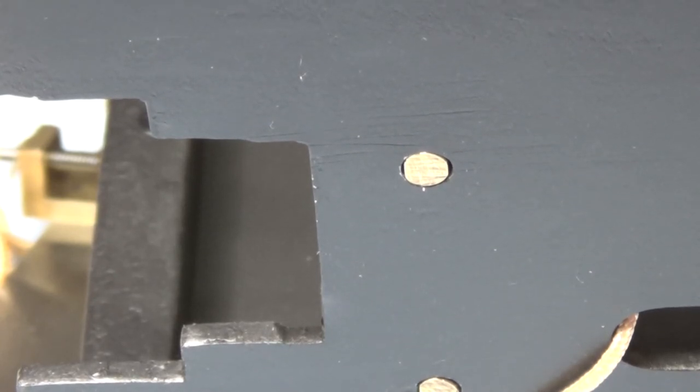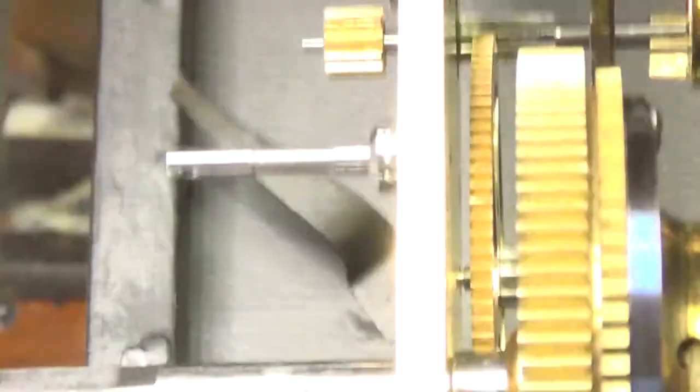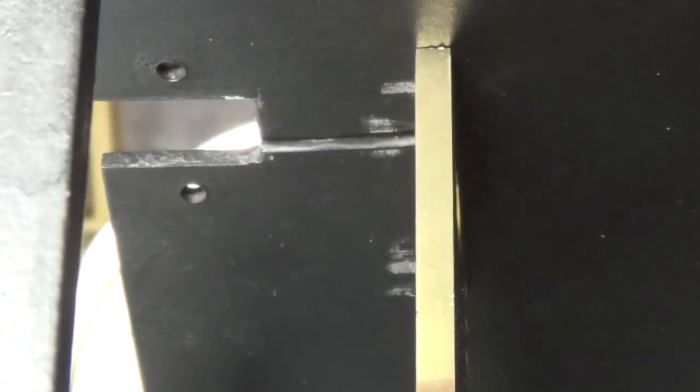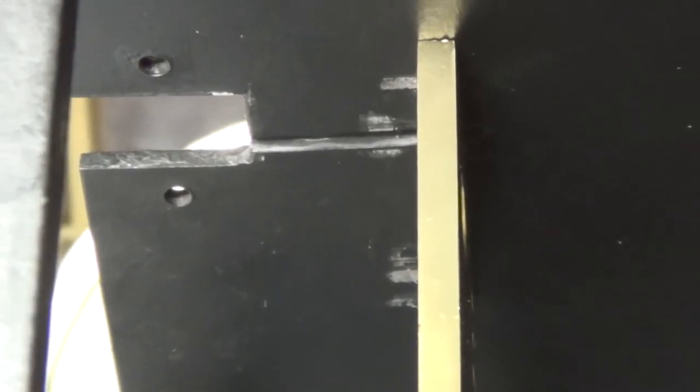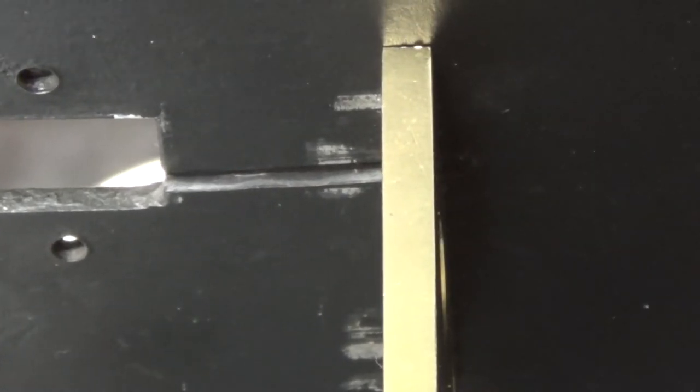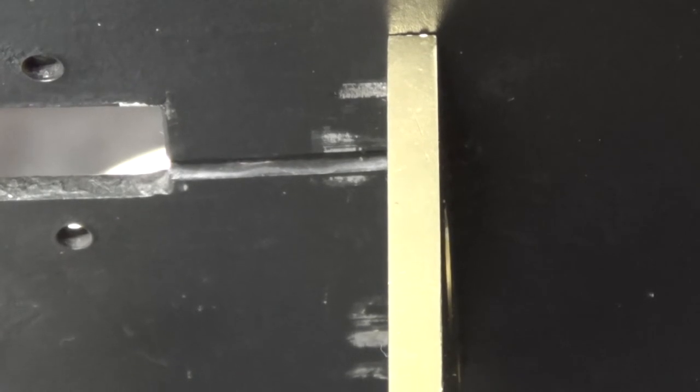The problem is when you look at the bottom, what you see appears to be either some kind of pins or cut-off screws. In fact, what they are is little nubs that are extensions of the brass plates that simply fit down into the holes in the bottom of the iron case. So by removing the top screws, on the inside of this movement at the top, there is also a little triangular groove — right there, you see it.